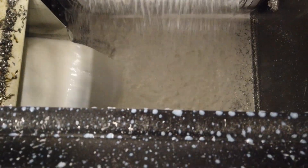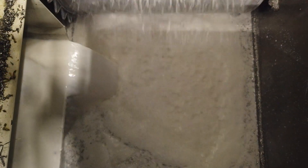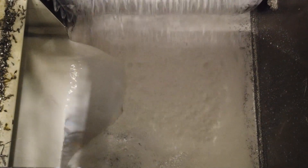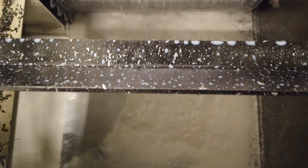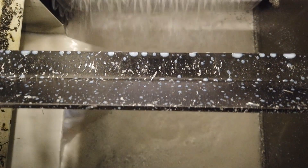Coolants have a maximum filtration they can run. A lot of coolant that has oil in it — typically 10 micron is the lowest filtration you want, and that's a pretty common filter. But what happens with high pressure systems is people don't change the filters often enough, and that 10 micron filter starts becoming like a 2 or even a 1 micron filter, and it starts creating big issues for the coolant.